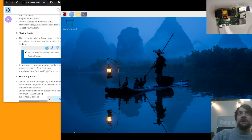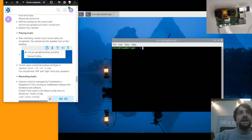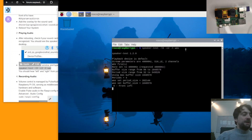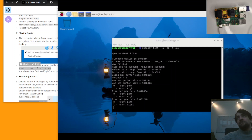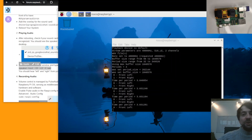The Raspberry Pi OS is now running. You will see two new icons: the first one is a speaker with volume control, and also one for the microphone. Let's try to play something — open a terminal window and type in the speaker-test command. You should hear: front left, front right, front left, front right. Audio is working fine.